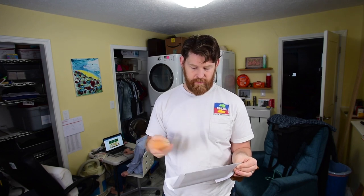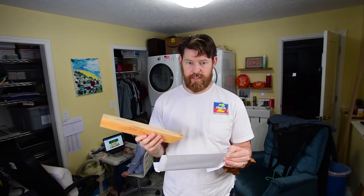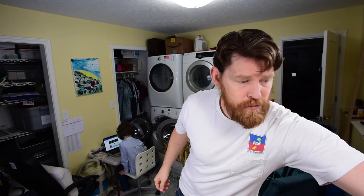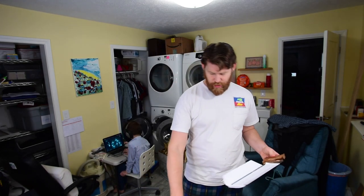So that's what I'm doing, and then I've got this little saw vise that I made for this saw, and so I'll use that to hold it steady. And I think I'm just gonna pull this part off of a combination square and have that set up on the wood to guide me to keep it perpendicular so my cuts don't wander as I'm making the cuts to start the new teeth in. And then I'll just file new teeth like you normally do. I'm gonna be using my jaw horse, which is awesome. So I'll just get to it and show you what I'm doing.